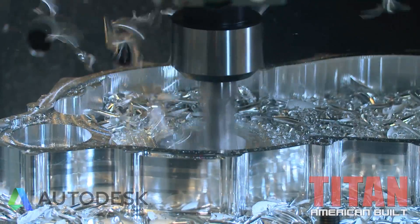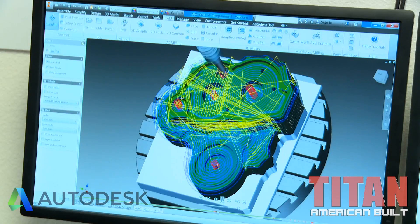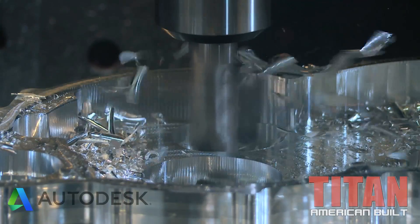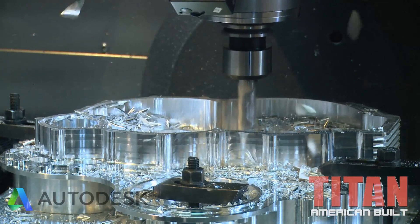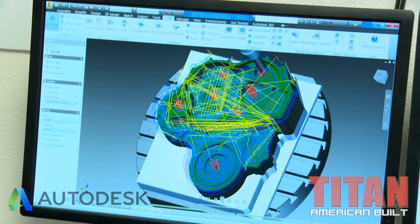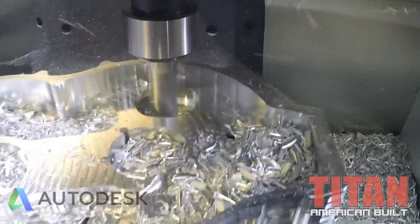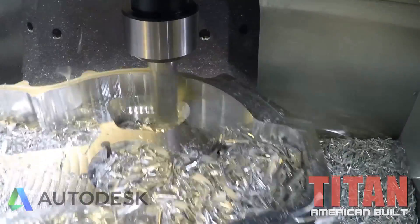When we're cutting titanium, Inconel, and even some of the harder steels, I always use coolant. I get away without it when I'm machining aluminum and other softer metals because I take nice aggressive cuts, keeping my spindle load down and keeping the heat out of the aluminum so it doesn't heat up and melt the aluminum to the tool, which would break the tool and cause damage to the machine.